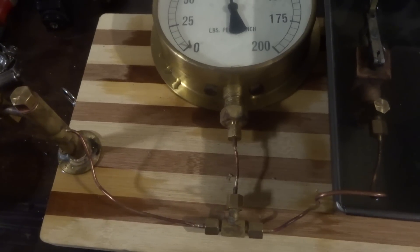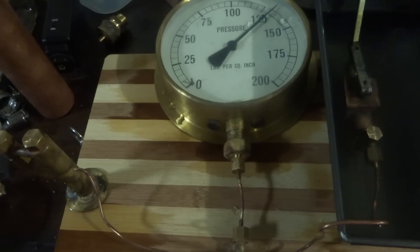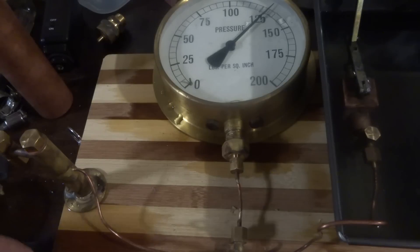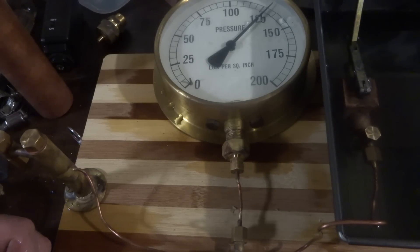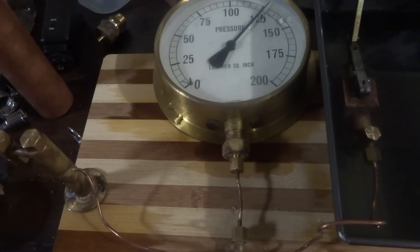Everything silver soldered up, so it's holding pressure at 100. Give it a pump and it's well over 130 — that should be plenty. That's about three times what I intend to run it at. I've had no end of trouble with this fitting here — it's an odd size and I've made about three different fittings to get one that worked. The first one cracked, the second one was no good at all, and this one seems to be okay. That's what most of the hold-up has been.